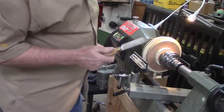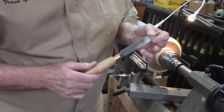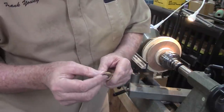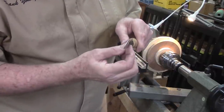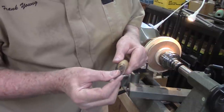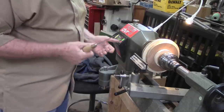I am going to use a little tool that I made. Tell us about that tool. This is a bread and butter knife I got from the Goodwill. It is stainless steel and it is tapered, and it holds a good edge. Thirty-second of an inch thick at the fat edge; up here at the top, it's probably a sixty-fourth less than that. I've got it ground so that it's cutting just a little bit up from the bottom. It does a great job.